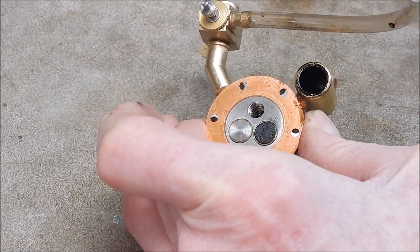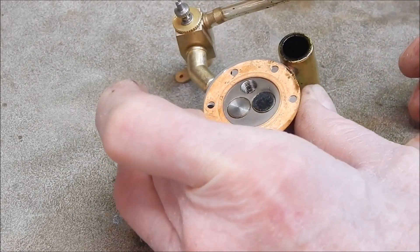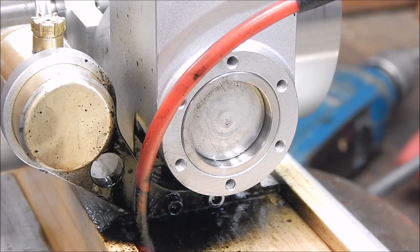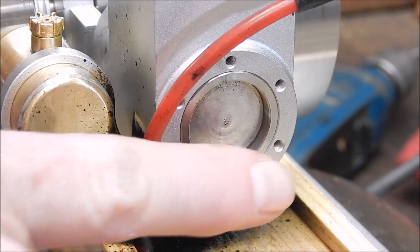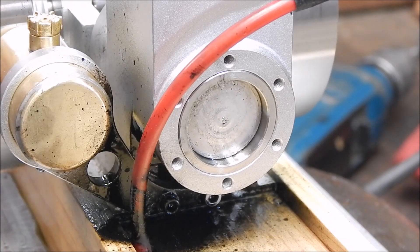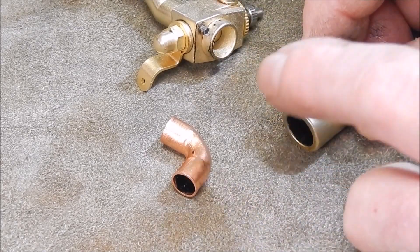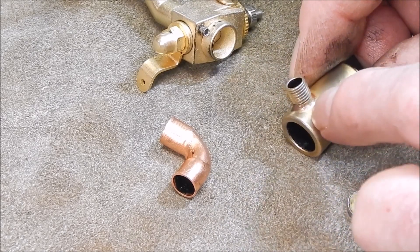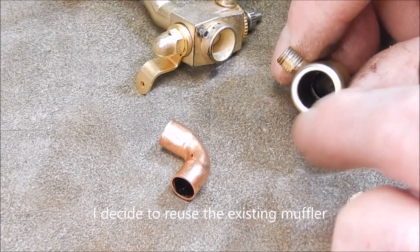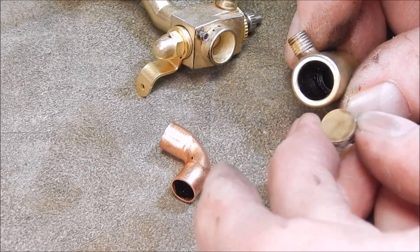You can see where it's popped the end off the muffler. That plug should be in there, but it's not. So I could easily fix that, but I think I'll make a better muffler. The head sits flat, so it's got a reasonable combustion chamber there. Having a close look at this, the little manifold that screws into the head is silver soldered in — that's what it should be — but this plug is plain soldered, which won't stand up to the heat.